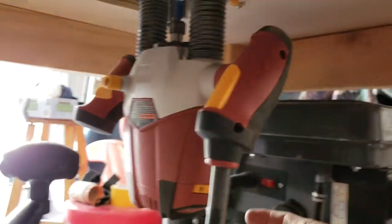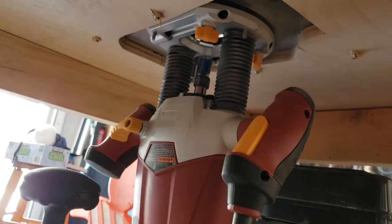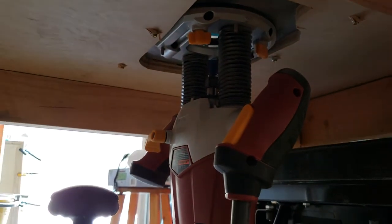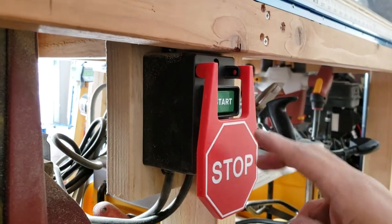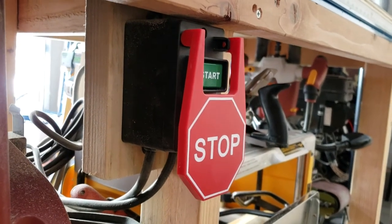The Harbor Freight plunge router — wait for it to go on sale. It's not the highest RPM for super big bits, but I don't do much exotic cutting. You just push the router up and then you can do routing. I don't have fancy dust collection for this — I just hold a hose where I need it, and dust falls through to the bottom where I vacuum it out. For safety I have a Rockler two-way switch: a start button and an emergency stop that's easy to hit with your leg or knee to stop something quickly.